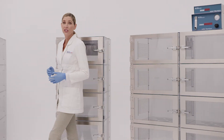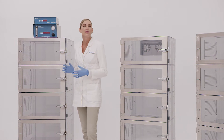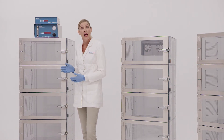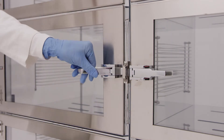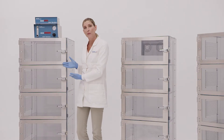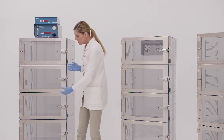Where the traditional model of desiccator cabinet is good for long-term storage, you can run into problems if you have to frequently access its contents. Every time you open a door, outside air rushes into the chamber. Close the door, and now you have a pocket of humid air sitting inside your cabinet, and it's only a matter of time before that humidity begins to creep into the other chambers.